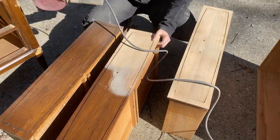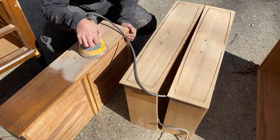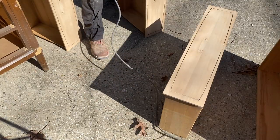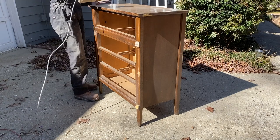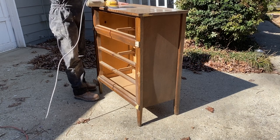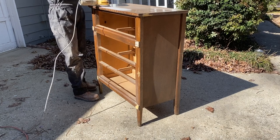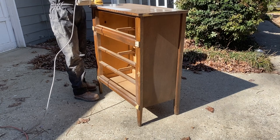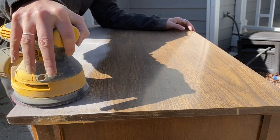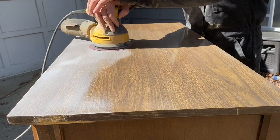Of course, if you're going to paint, you don't need to strip it down all the way to the natural wood. You can do what we call a scuff sand, which I'll show you in a little bit. This angle is perfect for showing the sheen on the top of the dresser — the reflection in it. This is a product of fake wood or laminate, and if you sand through it, you'll be sanding down to just nothing special. So what I'm doing here is I'm scuff sanding the entire top because I'm going to be painting it. With the scuff sand, we're trying to give the paint something to adhere to — giving it a nice rough scuff sand will give the paint something to stick to rather than trying to grip onto the slick surface.